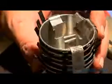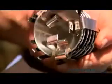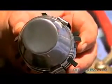We're actually shooting for a triangle pattern, so I may want to move this one strap down a bit to get more of an actual triangle pattern. This thing is very firm, and the only thing left to do now is adding an electrical jumper between cup number 5 and cup number 2. That's our negative plates. And you can see how this thing is holding together on its own power.